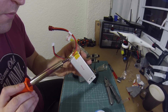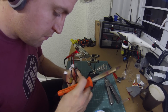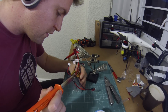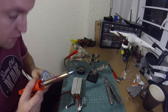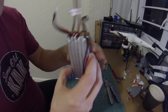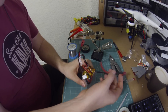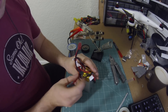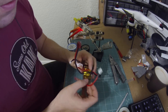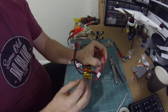Let's just heat it up first — this is where the 100 watt soldering iron makes a massive difference. With the previous batteries I did it with the smaller iron and it just took way too long. You can see that's a nice strong connection there, so I'm quite happy with that. The next thing we're going to do is take the negative discharge lead from battery number two, cut it to length, and solder it up onto this.